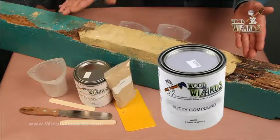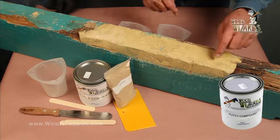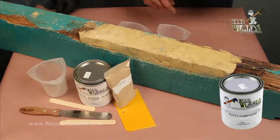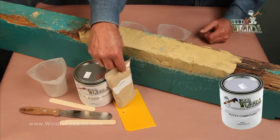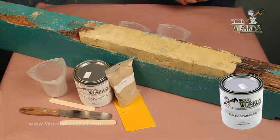Now Arnie, we've done a great job rough shaping the wood repair, but we've got some divots here and we've got a few little voids. What happens there? The Wood Wizard is still curing. It's going to cure for a while here, but we've got it really looking good, pretty close to the shape. We're going to add some putty compound onto it with some thickener to fill those voids, because the Wood Wizard doesn't go on less than a quarter of an inch.